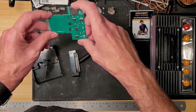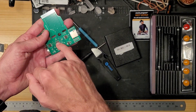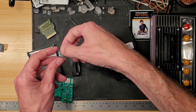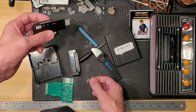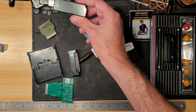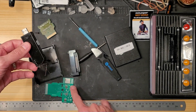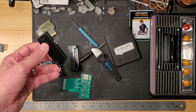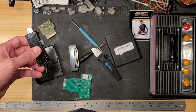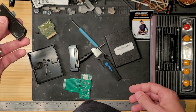So this is the MovieCart circuit board version 2.3. There are versions 2.3 and 2.4 — they're very similar except for the chip housing that's used. And here's the micro SD card you'll need. In order to put your contents on this SD card you'll need something like a USB adapter. Just slide the card into your USB adapter, plug it into your PC, and copy the file onto the card. Make sure there's nothing else on the card because the MovieCart circuit will just look for the first file it finds. Also, for best performance, format your card beforehand — that will make fast-forwarding and rewinding a lot smoother if the card isn't fragmented.